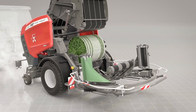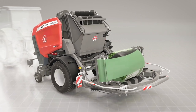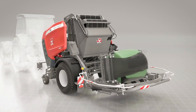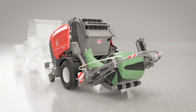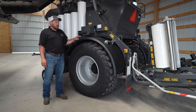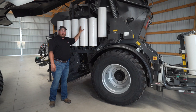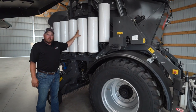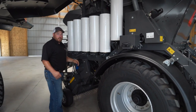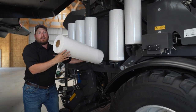Once the chamber has made and wrapped the bale, the transfer table takes nine seconds to transfer the bale from the bale chamber to the wrapping table. After that, the film rolls wrap the bale as it goes around on the table, which also rotates about the axis of the bale. Since this baler weighs over 14,000 pounds, it comes standard with a heavy duty chassis, high flotation tires, and onboard brakes. These are film storage rolls — there are six on either side, giving us a total storage of 12 plus the two already on the wrapping table. For easy loading and unloading, these rolls tip out to slide on and off the tube.